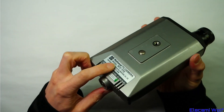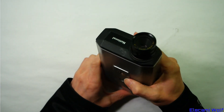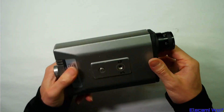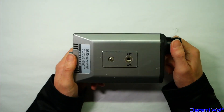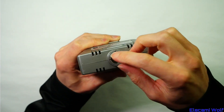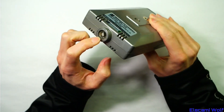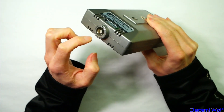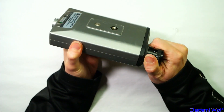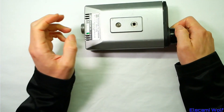Got here a National, or Panasonic as they were more commonly known, CCTV camera, WV71E. It's a black and white security camera where there's only one connection - a BNC coax cable connects on there, and that provides power to the camera, sync to the camera, and feeds the video back from the camera to a specific receiver designed to go with these, which is where the power comes from.